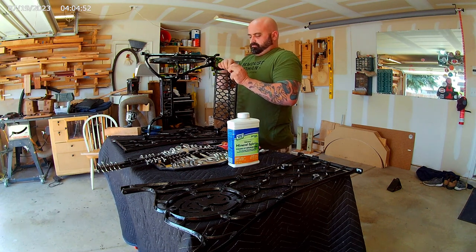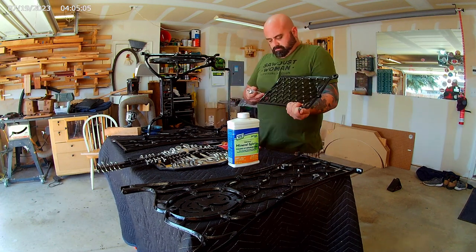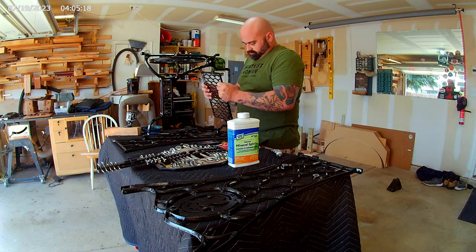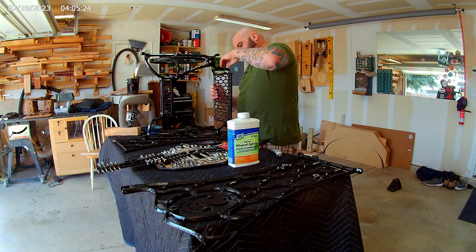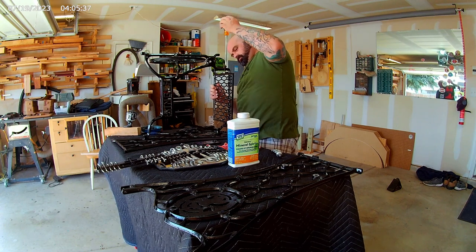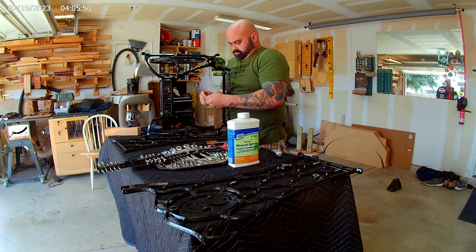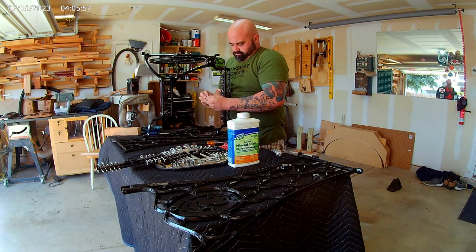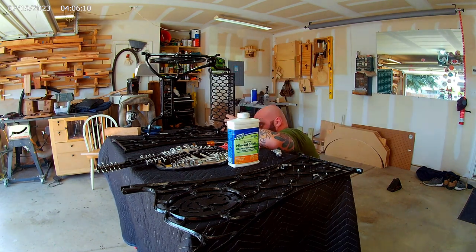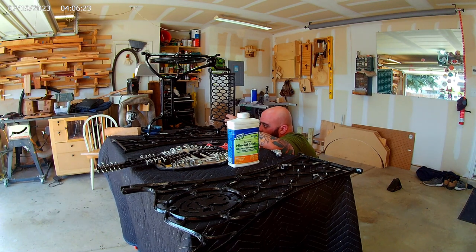The foot treadle is held in with two pointed set screws that also sit in cups on the treadle itself. Ideally, only one would have been removed to help with alignment later, but we couldn't have them powder coated and stuck into place forever. There was plenty of overspray, and lots of the hardware is tight-fitting, needed to be tapped out, or in some cases, even drilled out.